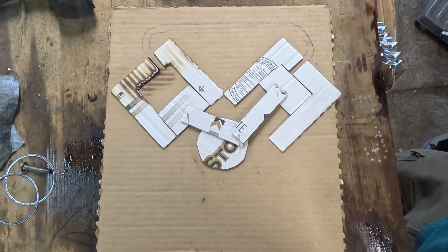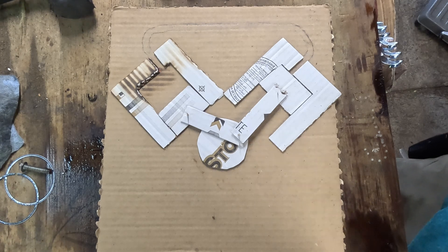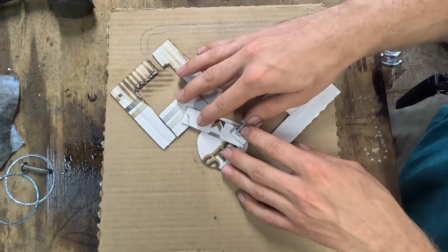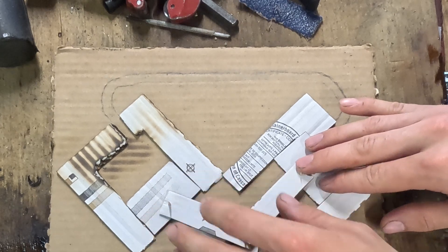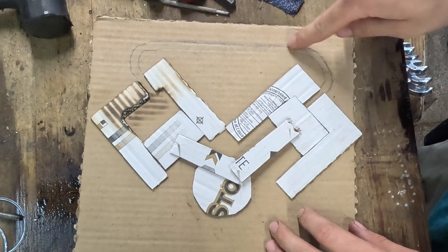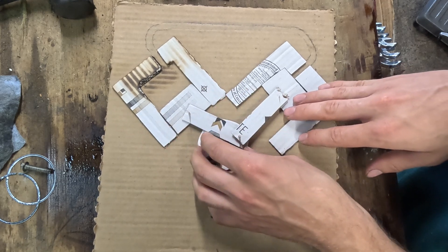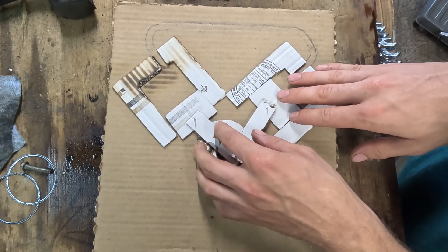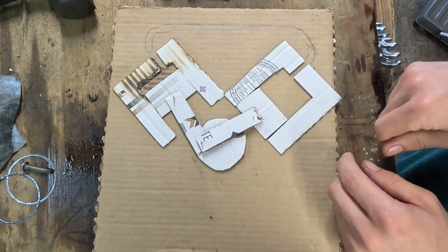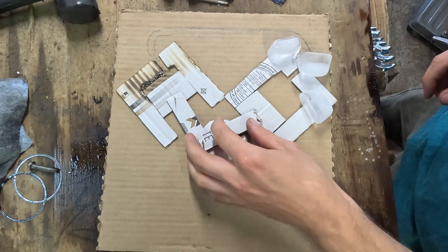So, how does it work, you ask? Observe the two-cylinder engine in front of you. One of the cylinders was just burnt with a torch, making it hot. In contrast, the other cylinder is not hot — mostly because it was not burnt with a torch. Both cylinders are connected together so air can pass freely from one to the other, as demonstrated by this hard-to-see pencil line right here. If most of the air is in the hot side, it will expand, pushing on both cylinders and making the engine rotate clockwise. Eventually it reaches a point where most of the air is in the cold side, causing the air to contract — pulling up on both pistons and completing the cycle.